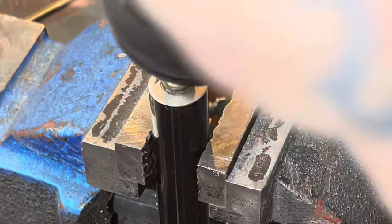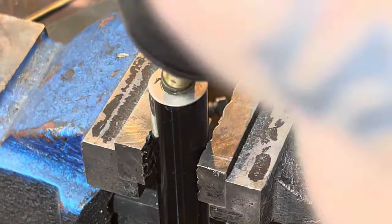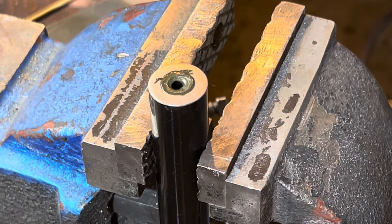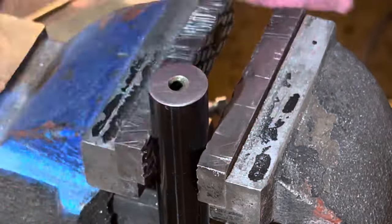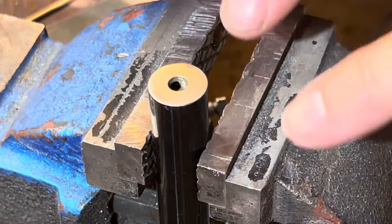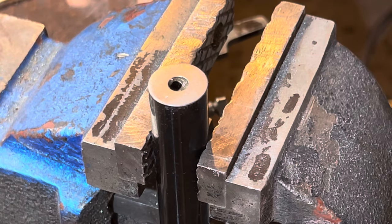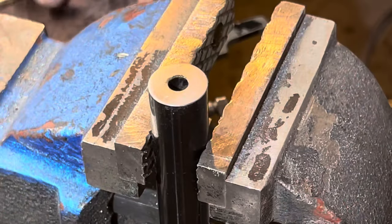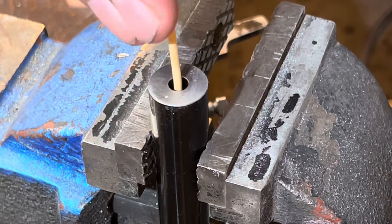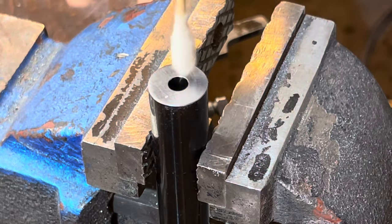It's important that you do different-sized oscillating circles. You can do really giant big ones and go really slow, but the bigger you go the harder it is to stay in the hole. You can also see how the compound is removed from the ball — you want to make sure you've got compound in there to do the cutting. I've done this many, many times with always improved results in my accuracy. You can buy or rent tools to do this more professionally. You do not have to have a lathe. 4D Reamer Rentals — Fred Zeiglin over there — will rent you all this stuff. You can even thread a barrel without a lathe with tools they have now.